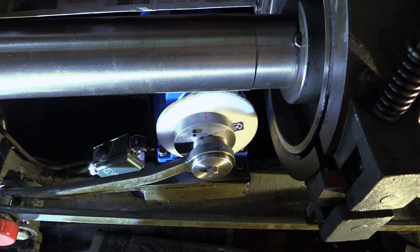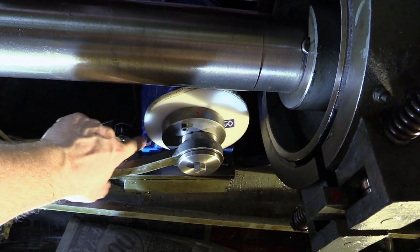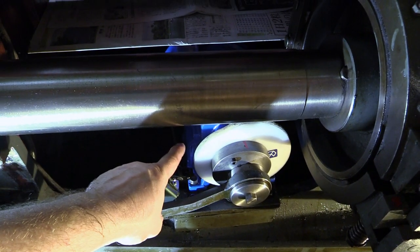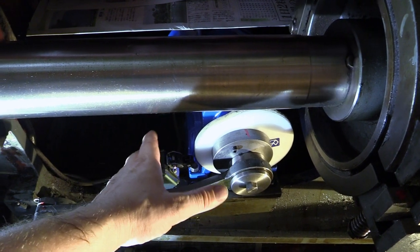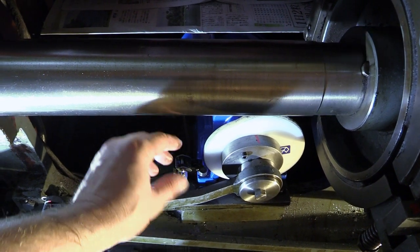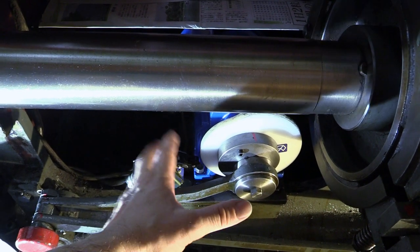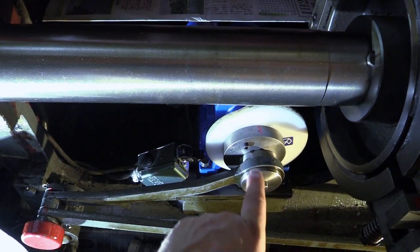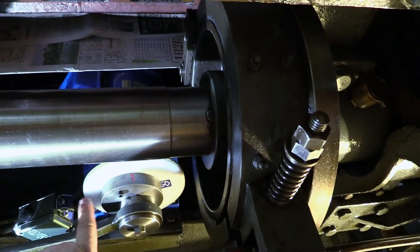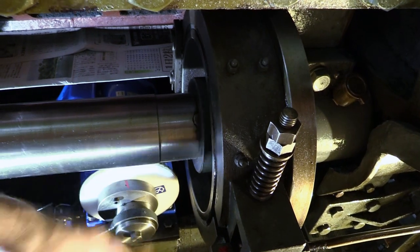So we got the new disk installed, all working quite well, fit perfectly. And a little bit of dirt on there — that's just from running against the limit switch here. We also had to replace the brake inside this motor, this blue part here. That motor there is an old motor, you can't buy them anymore, but it's a geared motor with a brake integrated in there. They're very expensive to replace, but we found a shop that could replace the brake pad — they made a custom one up — and that's now working perfectly. It was slipping and now it's stopping straight away. So as this rotates, it turns the clutch on, the machine operates, that continues to rotate around to the off position, then the clutches disengage, the brake comes on, the machine stops, waits for the next cycle, then repeats over and over.